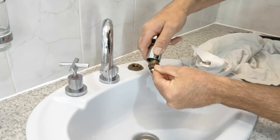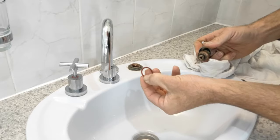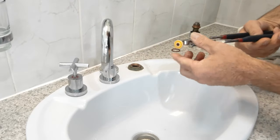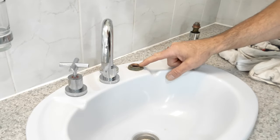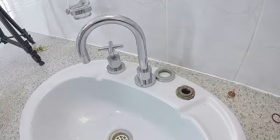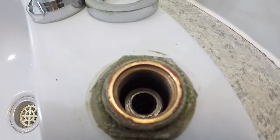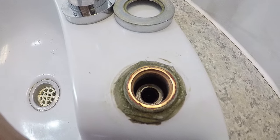There's the old fiber washer — that washer can come off. These sort of disintegrate, so that's actually one part we're going to get rid of. There's the tap washer. Now let's have a look down inside there at the tap seat that we're going to be grinding. That's the bronze tap seat that we're going to be grinding to give it a nice, flat, smooth surface for the tap washer to close against.